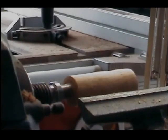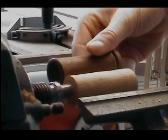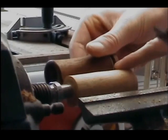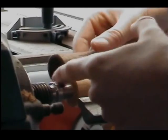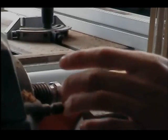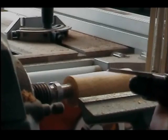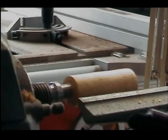The problem with that is when I was cutting barrels, I used to do that a lot, and I found that I cut a lot of them too big because I'd set them back about a quarter inch or so. And when I eyeballed it, it would come out about a quarter inch too big. I thought I was cutting in the right spot. Well, I wasn't. And it came out the wrong size, made it sound funny. So, just something to think about. You should probably use some of these calipers here, like I said before. Check it. See how close you really are. That's about as close as you can get.